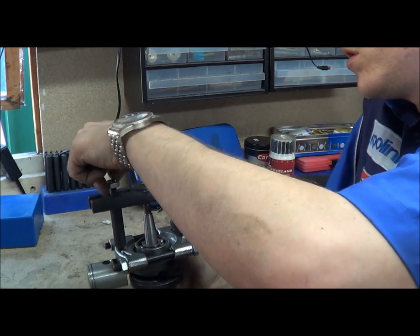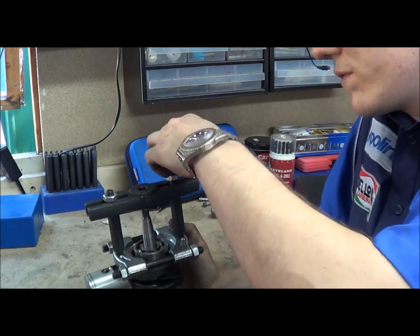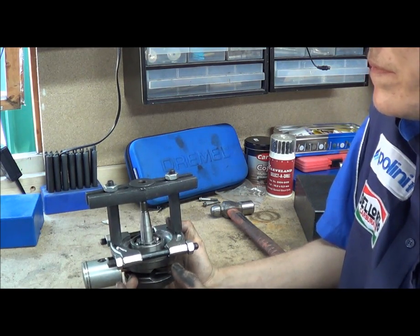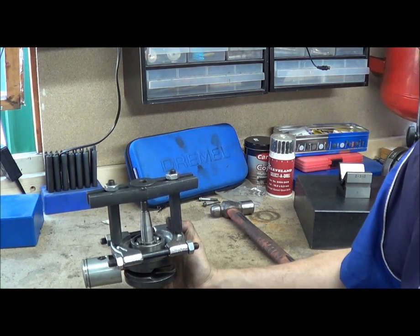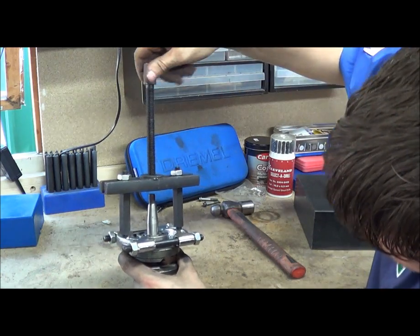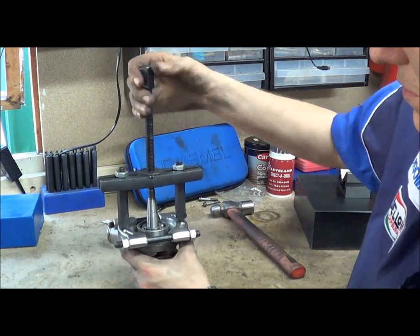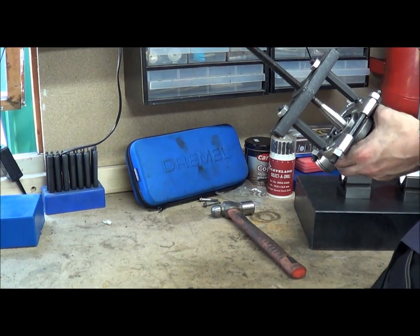You get your two nuts out of your kit and thread them on top — normally you'd use washers but this probably isn't going to take that much force. Sometimes you're trying to get big tapered bearings off shafts and they are seriously on there. So basically we're setting up a jig that grabs behind the bearing and locks everything into position. Then the hole in the centre takes the actual rod that screws in, and on the end it has a dimple that sits on the end of your crank nose — just like that. When you tighten this down it will press the crank through the bearing.